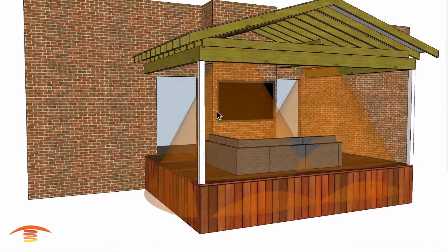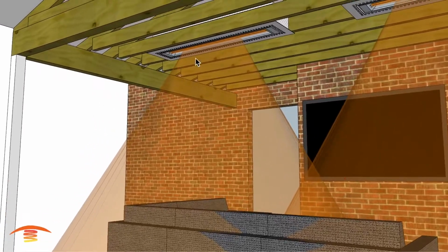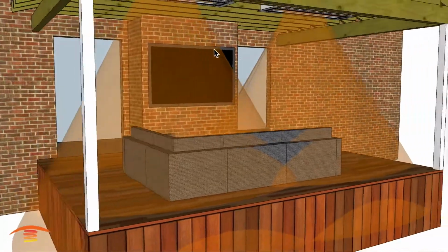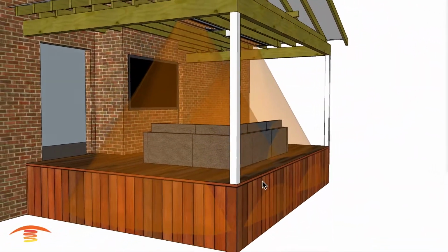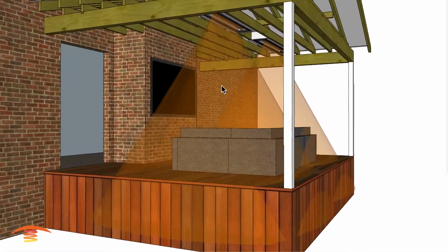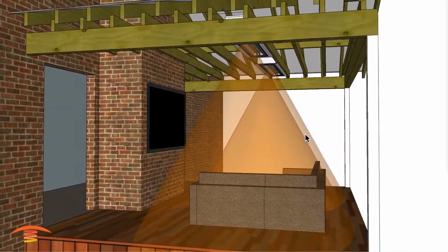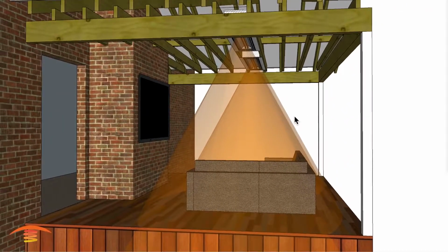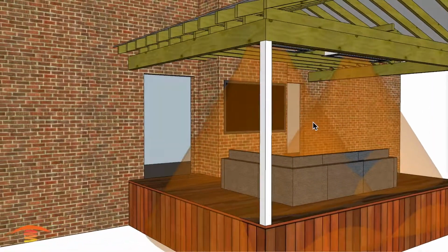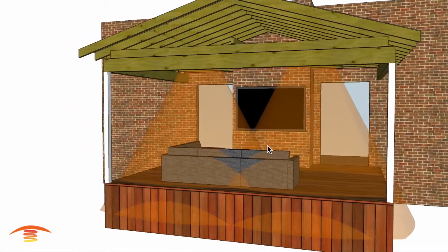And I want to just also mention, I forgot this, that these are 6,000 watt units. You definitely want to have a control system, minimum a duplex switch on this, so just bear that in mind. You can also use a 4,000 watt unit without a control. You can see the intensity is pretty high. It goes all the way down probably about another 2 feet further, so the intensity is kind of high on this particular application. But this is in a cold climate, and the seasons change pretty dramatically, I think, in this climate. So 6,000 watt would be my first suggestion with that information, and control would also be very important.